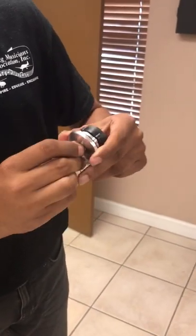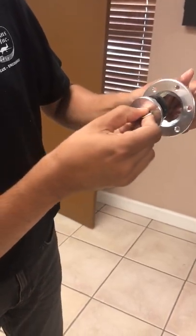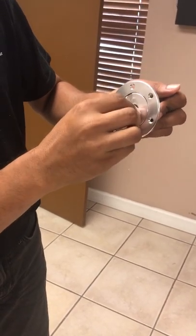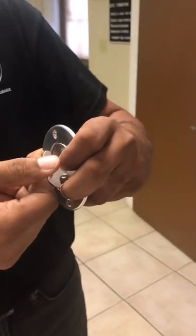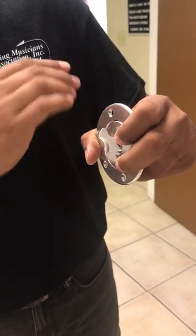Or if you did mess with it — like if you moved it — you have to bring it back to the correct position before putting it in. Now that it's lined up, if you put it in and align it here, you're going to only turn one way. If you try to go the other way, you're going to break off the ears that lock it.